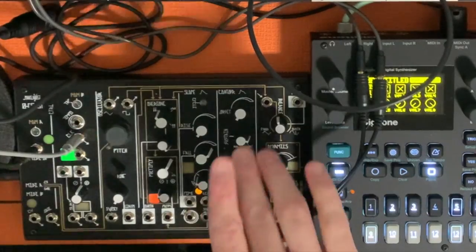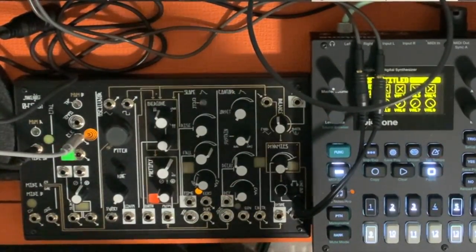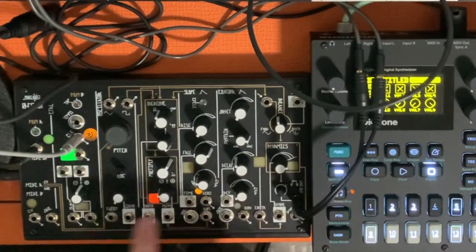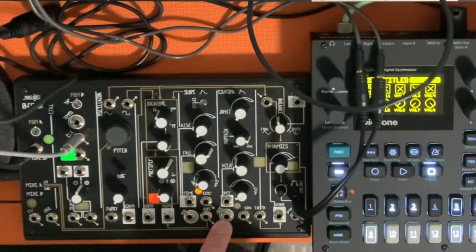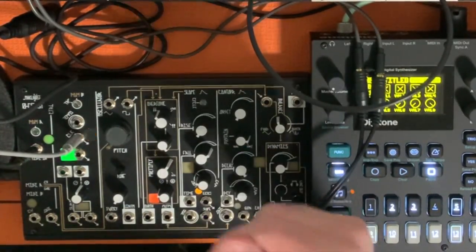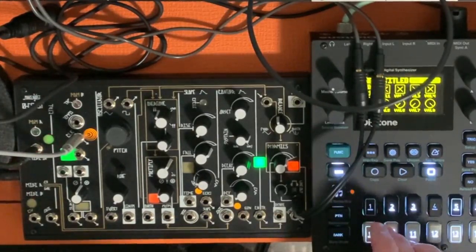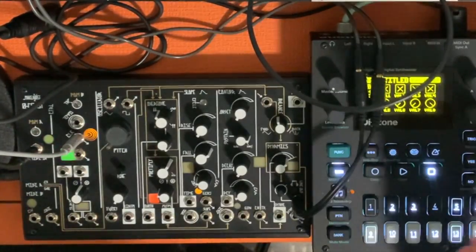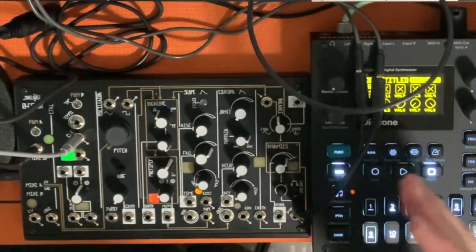Backing up briefly, because I realized I forgot to talk about it, there are two inputs on the contour. There's a gate input, which I mentioned is defaulted normal to the MIDI gate, as well as a decay input, which affects the amount of decay, and then an end of note. So if we press a note, we can see that the end of the note has happened, and that's going to send a gate signal,